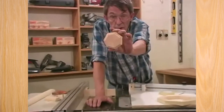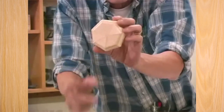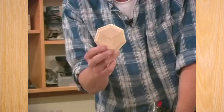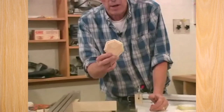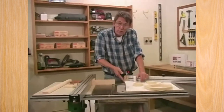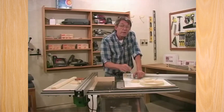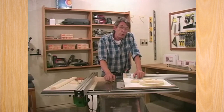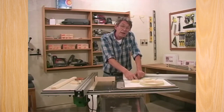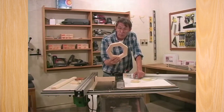Even the cutoffs fit. Roll the two ends together — right there, you see a little project that has absolutely perfect joints. The reason I wanted to do seven sides: the angle to cut seven sides is 25.714285 degrees by calculator. You're not going to hit that with the average chop saw. It's no harder to hit that angle than four, five, six, or any other — every shape has a marking on our scale that clearly shows where to set the backstop. The tear out is always on pieces cut from the side the jig's not on. Because we have zero clearance at the base of the platform and at the end block, there's physically no way that wood has a place to tear out. Also, since the W only swings forward, it automatically forces you to make cuts on your finished pieces with the grain, which also eliminates tear out.